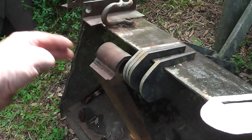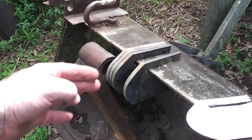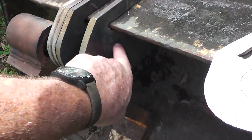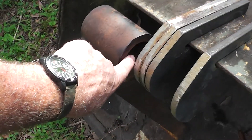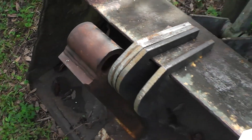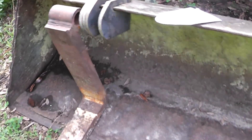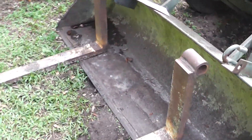I'm going to put one on each side of the fork and put a pin through there. These are half-inch steel. I just have to drill a two-inch hole saw — something that will fit through there — and get those welded and mounted. Alright, let's get to it.